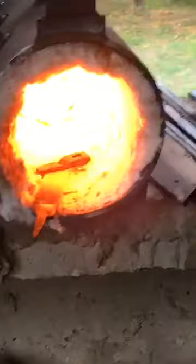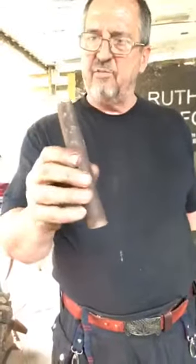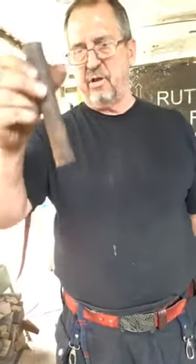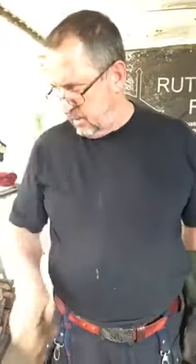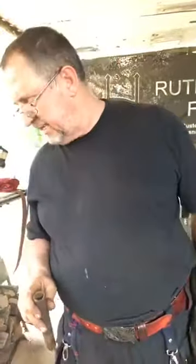Again, back on me. So for hot fitting, you need this very expensive tool that'll cost you an arm and a leg to make. It's a bopping tool. You guys will know it from putting your bolsters on. So we do it exactly the same way with hot fitting. We're going to use this to force the guard down to the shoulders. So we're going to get it nice and hot, and we should be able to get this in one heat.